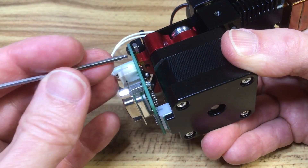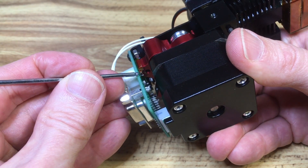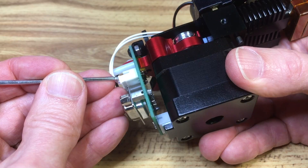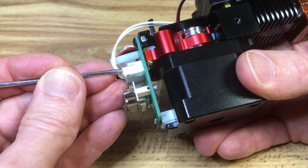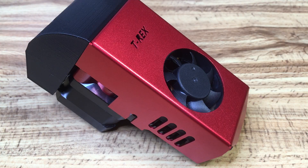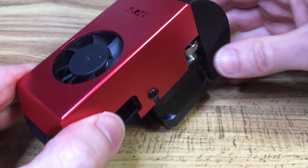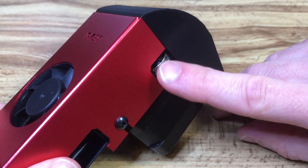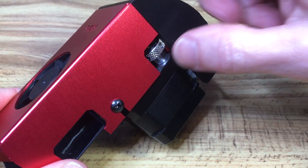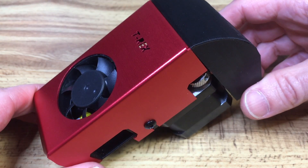I've put the connector board back on now. You can see how close the Flexion hardware gets to the solder joints at the connector on the circuit board. If there is any problem with these connectors — this cable connects to the thermocouple — you'll see bad temperature readings or no temperature reading, so just keep an eye on that when you first power it up. The extruder is all back together again. The original covers fit over the Flexion parts. The only thing is the control knob is hard to turn with the standard T-Rex covers on, but that's not a big deal — I just take off the cover, adjust it when needed, and put the cover back on. Everything else fits great.